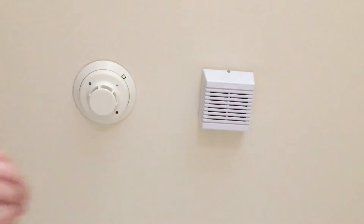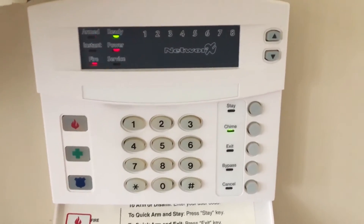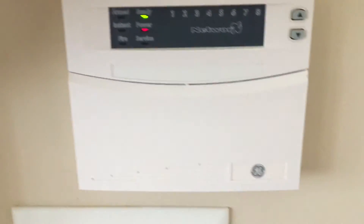I am now ready. Let's go ahead and push the test button. You can see that the detector head just turned off. What it's now doing is the detector is going to be power cycled by the panel — just cutting the power off and turning it back on from the detector head. It's now going to wait 120 seconds for the detector to activate again, which we're not going to do this time. Actually, let's just for fun set it off again. You can see the detector has gone off again. We reset the panel — star 7 does reset the system, so everything should be back to normal.